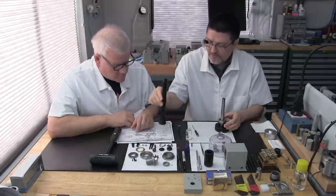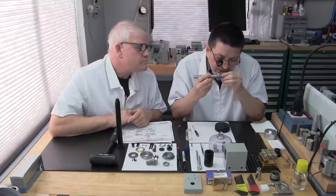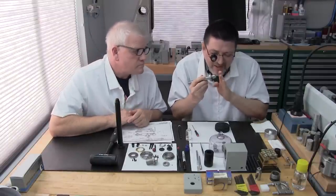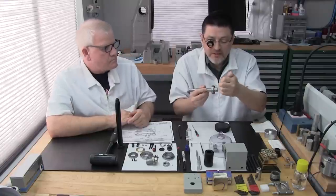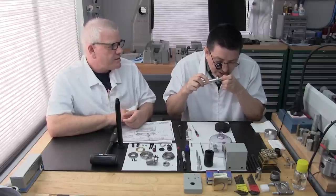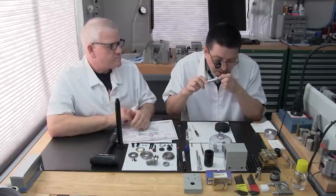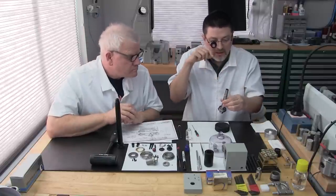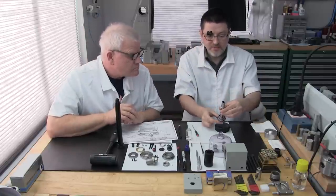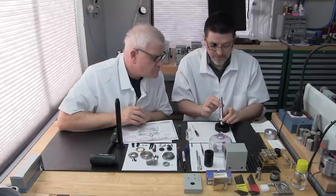Okay, take that off. Then with my loupe, I just like to get a visual confirmation that the inner bearing race is seating on the spindle edge right there, fully, all the way around, just to be sure. I mean, odds are good, but I'm just turning this. I just want to be sure it's sitting perfectly around the entire circumference of the shaft. Okay, it looks really great. Next thing is my witness mark. Make sure my witness mark didn't move. Okay, no, it's perfect.